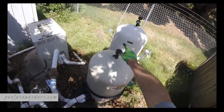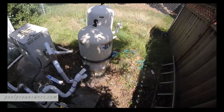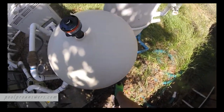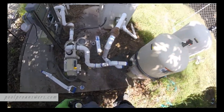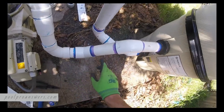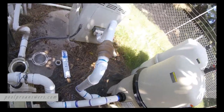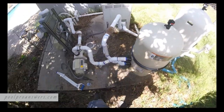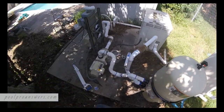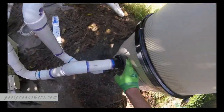So that's pretty much it. We need to put the pressure gauge, install that. This is already torqued down. See, the springs are touching. Could go down maybe a little bit more. Everything's tight. See, we tightened that, glued that, glue, and glue. So we want to make sure everything that we cut, we've glued. So we're set. We just have to come back in a day and start it up. Technically, it's set within a half hour, but I want to leave it for at least a day.